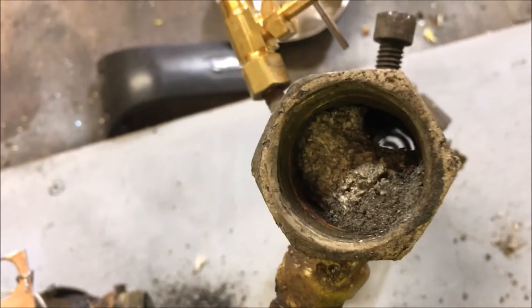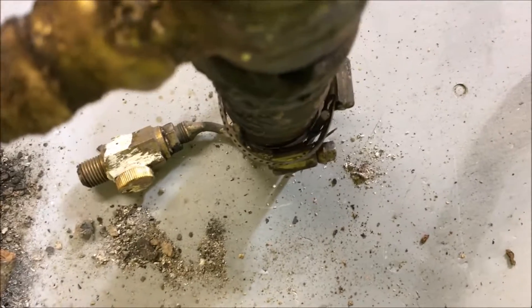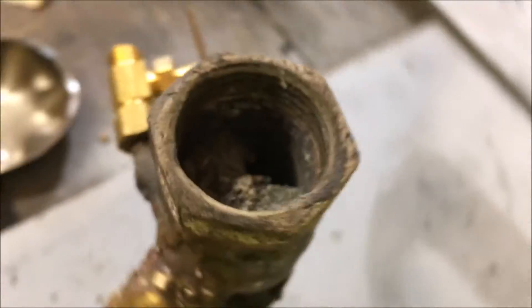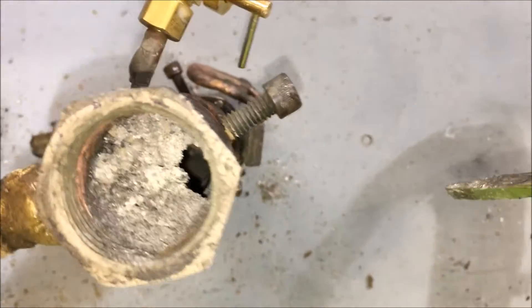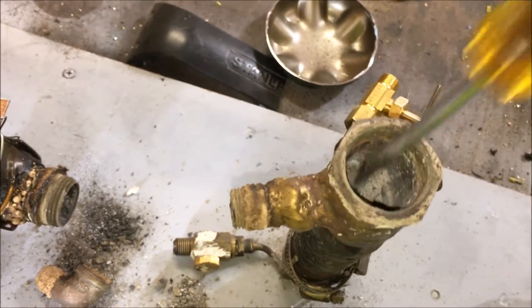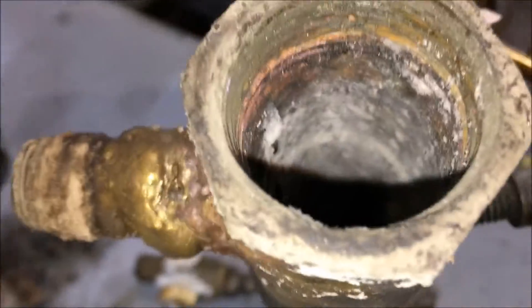As you can see here, there's a massive column. See that big bridging block? That's my clog right there. It's all ash. The entire intake area was clogging up — only a small portion of it left. That stuff's pretty hard. We got only that small little column there.